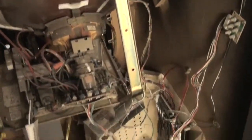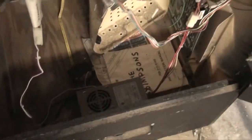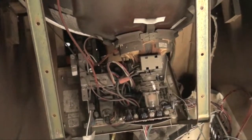On the back here you can see inside a little bit — pretty dirty. What we're going to do today is pull this monitor chassis out and give it a cap kit and clean it up. Everything does work; I did test it and the monitor picture is okay. We'll start by cleaning this board up and giving it a cap kit, then I'll throw a new power supply in eventually and clean up the cabinet, repaint the black, and do a bunch of work. So today we're working on the monitor and giving it a cap kit.